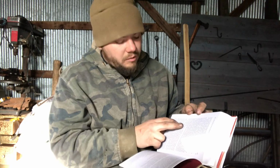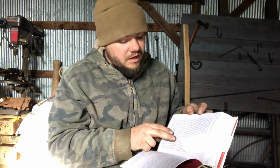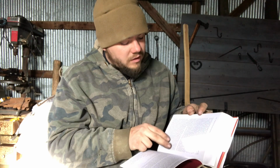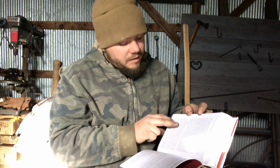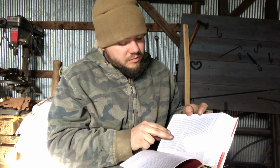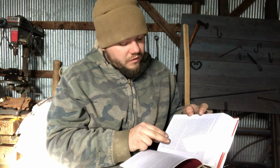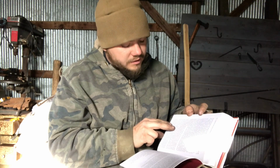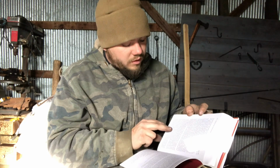A better material, however, is composed of leather and hoof cut into pieces of about an inch in size, adding 3 layers of salt, the proportions being about 4 pounds of salt to 20 pounds of leather and 15 pounds of hooves. Adding about 1 gallon of urine after the box is packed. The box lid should be fastened down and well luted with fire clay. It is then placed in a furnace and maintained at a red heat for about 12 hours. The articles are then taken out and quickly immersed in water, care being taken to put them in the water endways to avoid warping them.